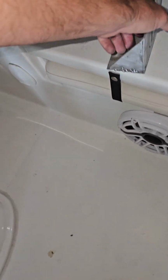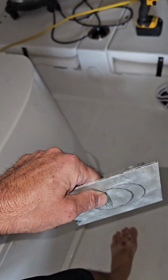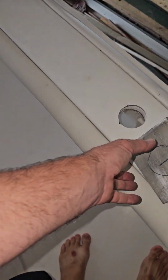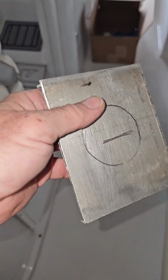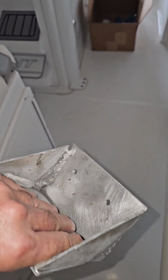And I can weld. If you can't weld, then all you do is, let's grab one of these over here. All you do is get some 1/8 inch aluminum, take your measurements, and you can cut this stuff with a saw. Cut it, take it to somebody, and just have them TIG your edges. So it's pretty simple. But I'll show you what I'm talking about on these gunnels.